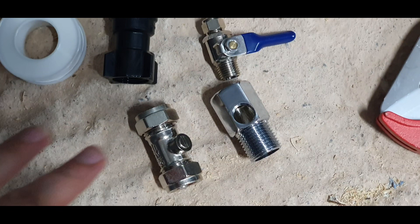If I'd had the valve there, the tap would have been on this side — it's just the way it all fitted together. It's not really a problem because I've got a stopcock down there anyway, so if I want to turn the flow off to the RO or to the tap I'm going to be using that stopcock, and I'm just using the pressure valve as a connection fitting really.